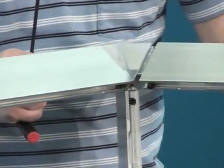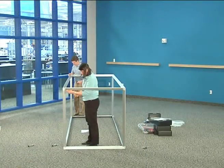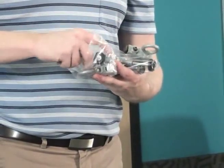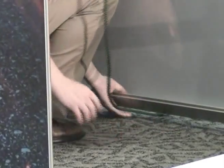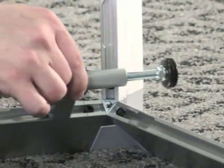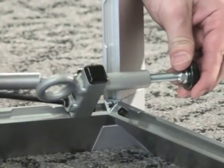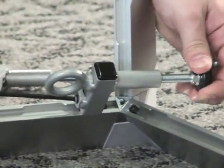Once all the sections have been joined together, add the vertical length to the base and top sections. Standing frames require the installation of 4 corner feet, which creates a space for electrical cords to run under the frame for internal or external lighting. The multi-purpose foot includes an eye bolt, but it can also be moved to the top of the structure for cubes that will be rigged from the ceiling or other structural hardware.